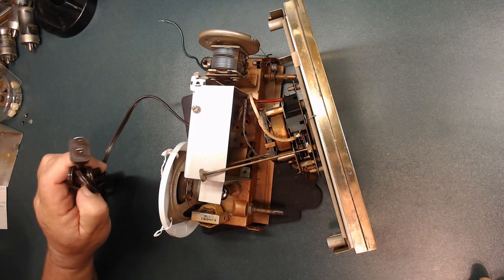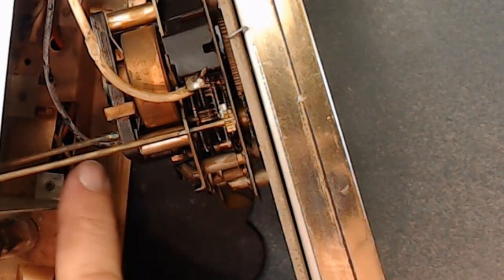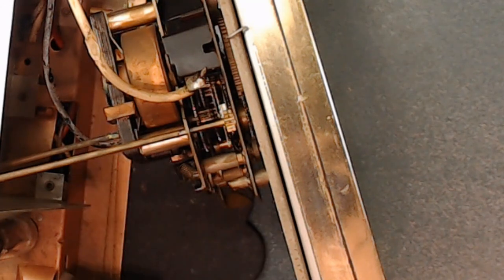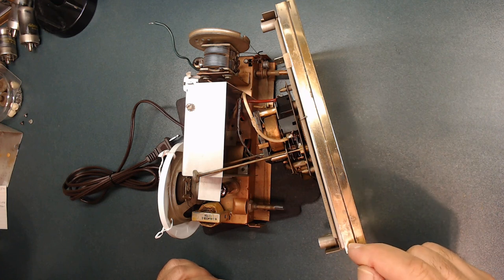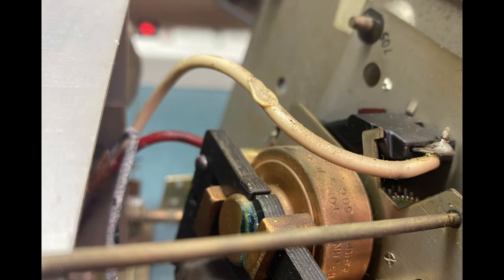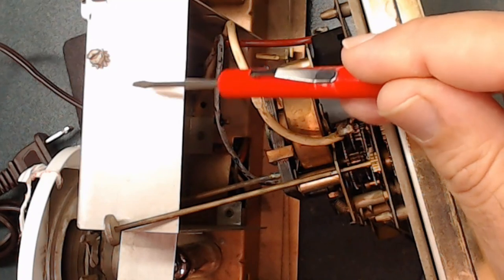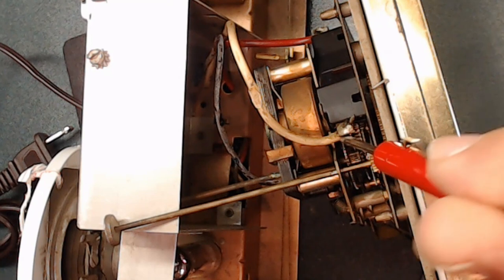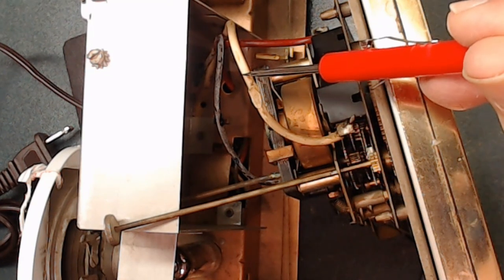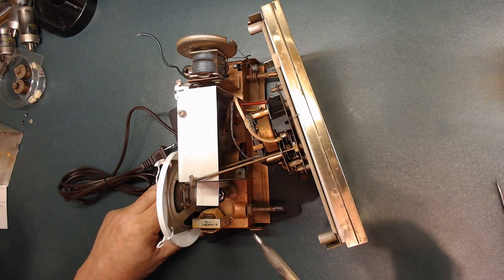The polarized cord is installed. I need to take this apart because one of these wires was rubbing right here — you see this green area. There are three screws on this side and three others that I removed, plus a couple of clips holding the plate. I'll find a solution because this wire at the top, the white one, I believe is a ground. You can see how it burned out right here — it was rubbing against the chassis and got pretty hot. I have to unsolder this and install some type of insulation because it's getting too close to the wire.